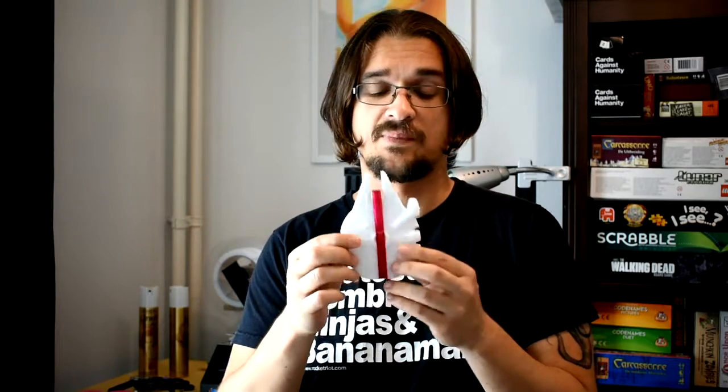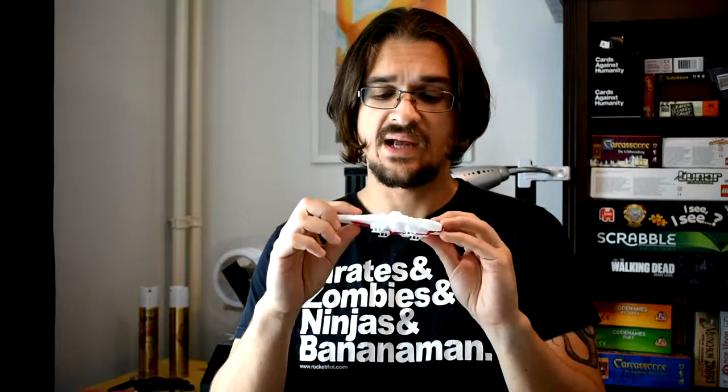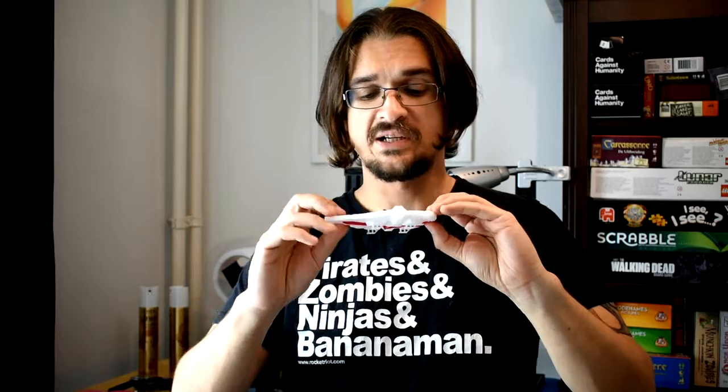The white is a GTEC or Giant Arm white PLA, and the pink is the ColorFab Translucent Pink PLA. I only had a sample of this ColorFab PLA — probably going to be ordering more. It's the same brand that I printed the Thrall in last week. Basically what I did was I set up some Cura settings to allow me to pause the print at certain heights, and then I could come in, manually swap out the filament, and resume the prints.